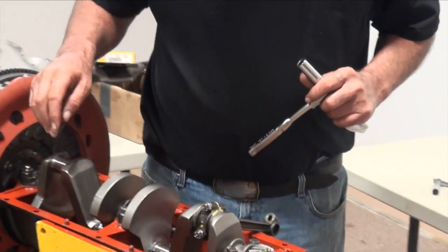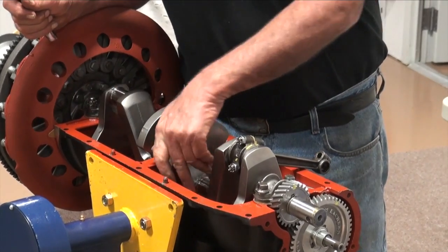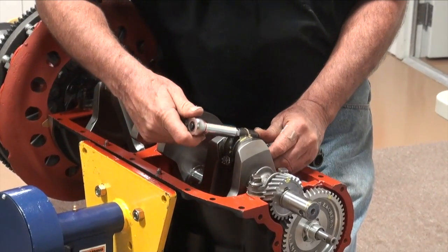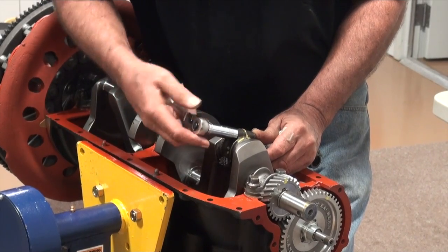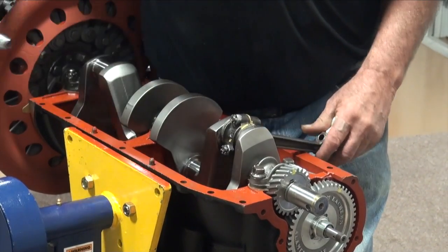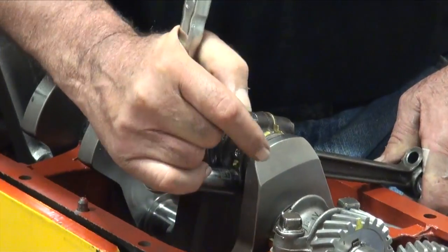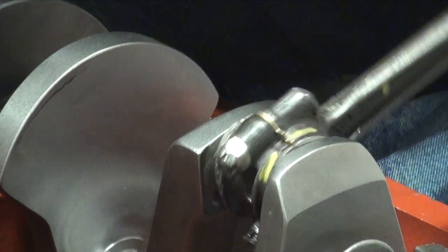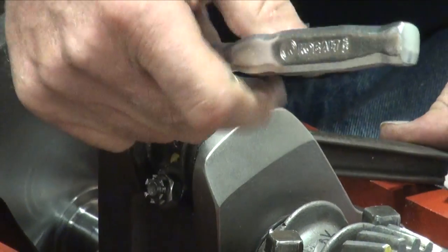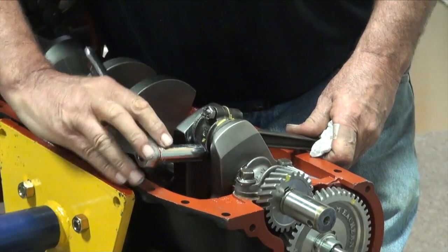This is a new SCAT crank, so the journals are probably — since the other crank was supposed to have been made off of the Ford drawing as far as bearing sizes — it'll probably be a little snug on the radius and just have to take a Babbitt knife and kind of clean it out so we don't have any contact. As you can see that's kind of stiff, so I'm just going to tighten it down, wipe it back and forth here a time or two. It's dragging, and since I have it on there dry, it's going to shine up the Babbitt in the place of contact.